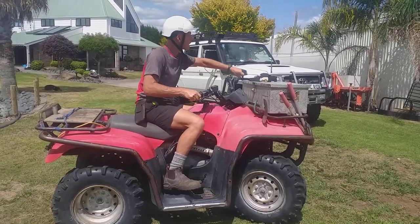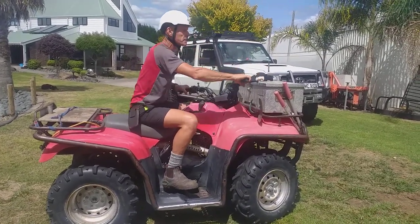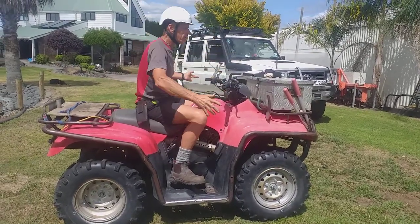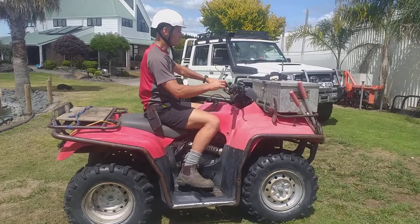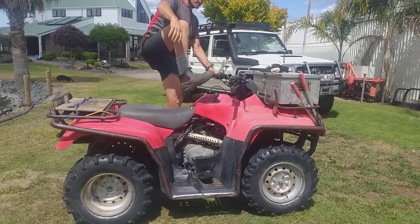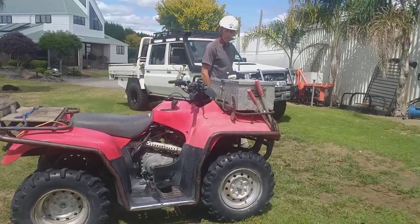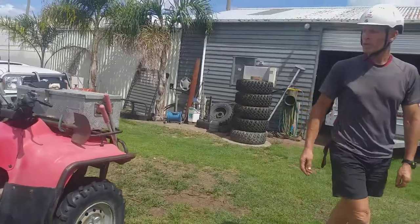While you're out there, make sure that these brake levers aren't hitting anything up front like boxes or containers, because if you hit a box it's going to jam down and throw you off. Everything clear, everything's secure. Dismounting — getting off this side, three points of contact again. Don't swing your leg through here and snap things off — just do it nicely. Coming around the machine for a good last check over it. Make sure it's washed before you check it — it's much easier to do.